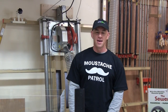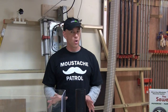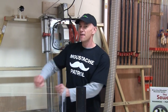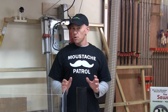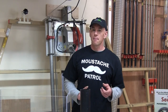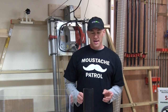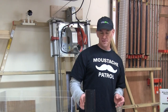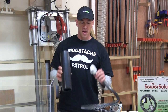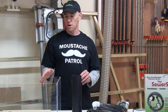Why in the heck would I do that? Well, I'll tell you. The standard RV advice is to not empty your tanks until they're three quarters full, so that you get a good rush of fluid and it carries all the stuff out of your tanks. That's always made sense to me. At the same time, there are a number of people that use other products like a macerator pump or something called the sewer solution that empty through a one-inch hose. You don't have to have been at the head of your class in fluid mechanics to realize that this is going to empty a tank a heck of a lot quicker than this. So it seems that the sewer solution or a macerator pump is sort of at odds with the traditional RV advice.